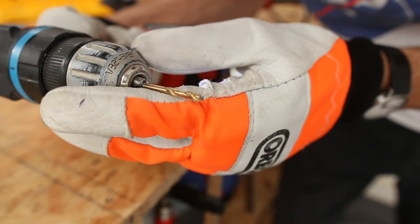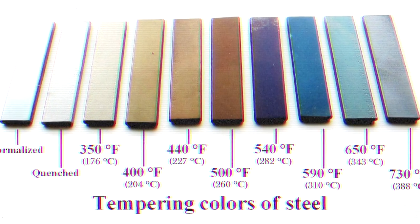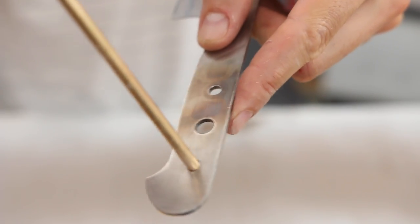The reason why I'm struggling so much is that my blade is tempered — it's almost as hard as my drill bit. Real metalworkers would definitely remove the temper first before working on the blade, but me, I'm just a punk. If you need more info, I'll share them down below. Finally, I'm using a file to make it smooth, flat, and to get rid of any shards.